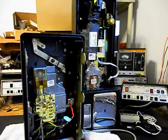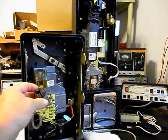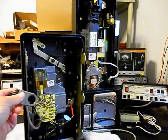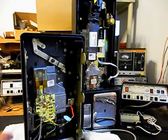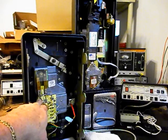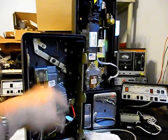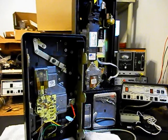We have our plug here, and that would plug into the main PC board — it's not going to be used in this repair and conversion. We have a wiring block here. We have our hook switch. And then we have our wires for our security cable for our handset. So we'll be going through all that and converting and repairing what we need to.